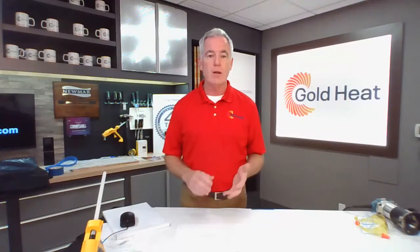Luxury vinyl plank is a waterproof product. So now you're no longer worrying about your maintenance. You're not worrying about flooding the floor. As long as it's not so much that it gets around the floor to the subfloor, you can still have issues. But to a large extent, it's almost like putting in sheet vinyl. It's not. They click together with a watertight joint, so it's not going to allow moisture to travel down to the subfloor, and the product itself is not going to be hurt by moisture.